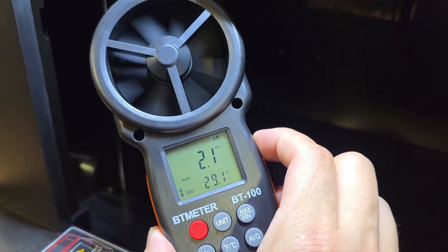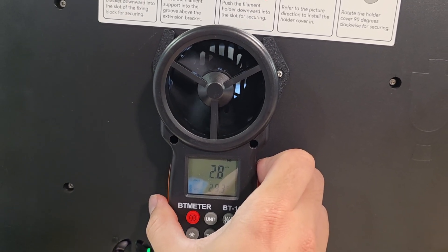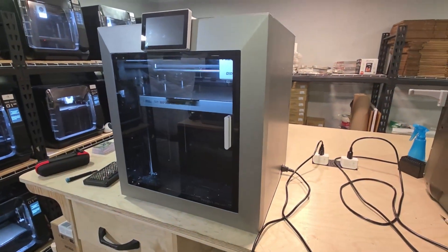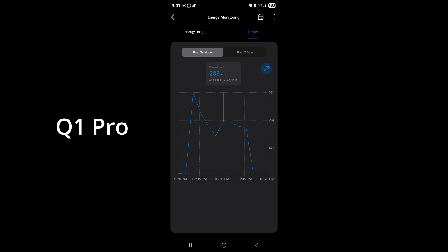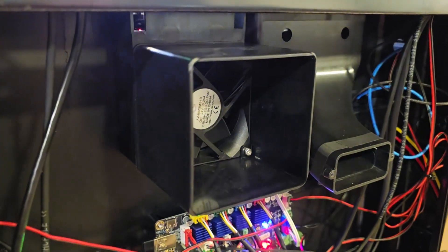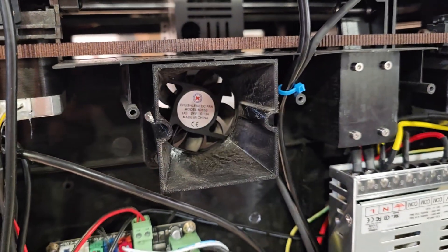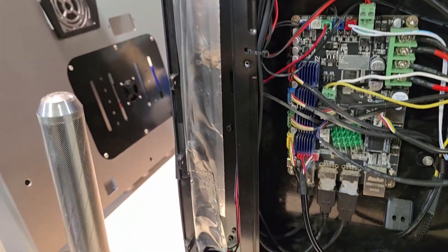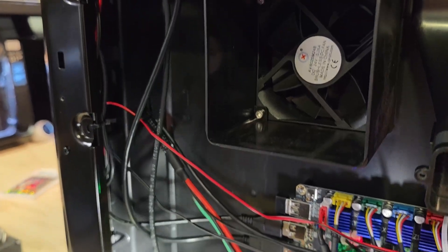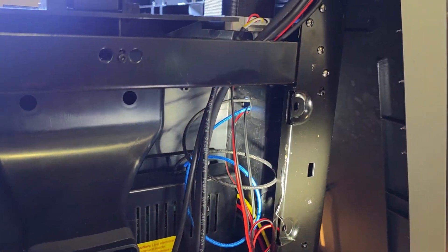The Q1 Pro also has somewhat of a balanced airflow — the exhaust is slightly stronger than the heater, which creates a slight negative pressure, which is ideal. When running the heater while exhausting the hot air, the Q1 Pro maintains temperature and consumes 290 watts during normal printing. For the Plus 4, it consumes 420 watts, so expect a 25–30% increase in power consumption if you want to run the exhaust at 100% and maintain 60 degrees on the chamber temp. An improvement on the Plus 4 is the addition of a baffle to keep hot air away from the electronics area — this is something I had to print and install myself on the Q1, so I'm happy it comes standard. Additionally, I had to seal the gaps on the Q1 with foam and HVAC tape, while the Plus 4 has no significant gaps that I can see. I think Qidi did a great job addressing the problems the Q1 had and making ventilation overall more effective.